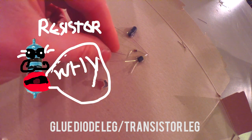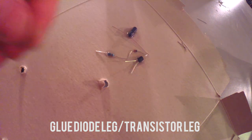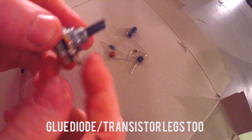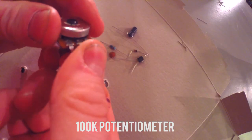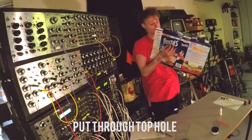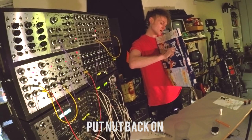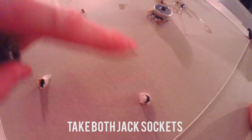It doesn't matter which way around this one goes. Split its legs open — you've got it going down there. Bend the legs forwards a bit so they look like that. You're poking through the top hole and popping back on this side; make sure it's nice and tight. Do the same with these into the two holes.